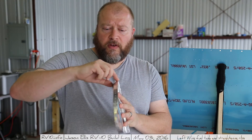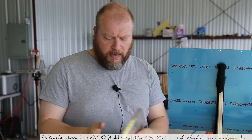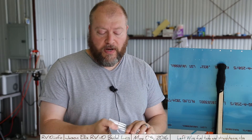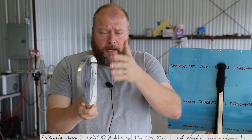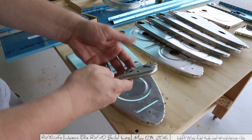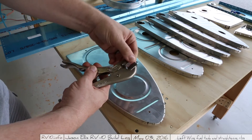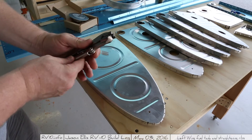That's because there's an ever so slight curve in the part that's just caused by the stamping — I'm sure there's no good way to avoid that when you create the part. The best way to tell is if you look right down it, you can see there's a curve. And they give you a great tool for solving this — well, you've got to buy it. It's a fluting tool: a pair of locking pliers that someone has welded channels onto, and it makes your life really easy for fixing this problem.